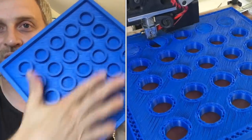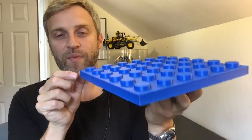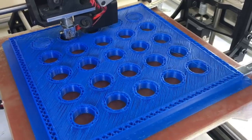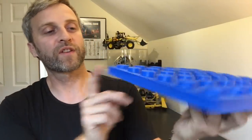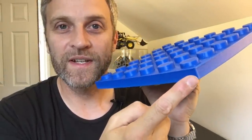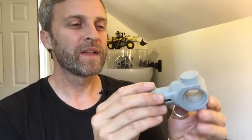It did want to warp off the bed, and you can see I put a massive brim on it — about 10 to 15 millimeters. Once the brim was set and the printer had gone up a few layers, I actually put crocodile clips on the edge of the brim to try and hold it down. That did work apart from one corner I couldn't get to because the crocodile clip would interfere with the machine — and that's the one corner that did peel a little bit, but it came out good enough.